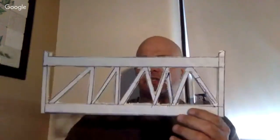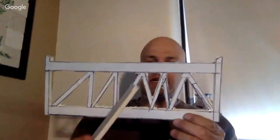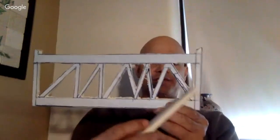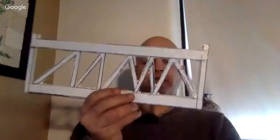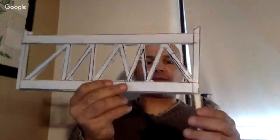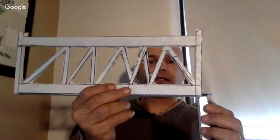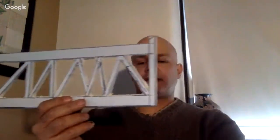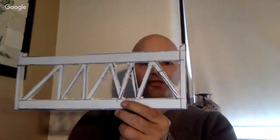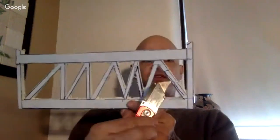Now the loads, theoretically, as everyone visualized, are transferring down these uprights and diagonals and over to the pier, left and right, north and south, west and east, however you like to orient yourself, transferring down to this, the pier. Here's the pier. What we know, hey John, glad you jumped in, is that we have a split in here, per the photographs, pre-meeting, and obviously post-meeting, because it didn't fix itself.